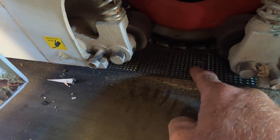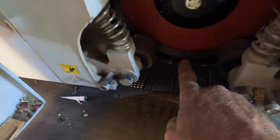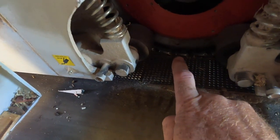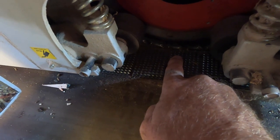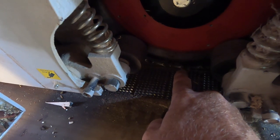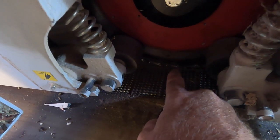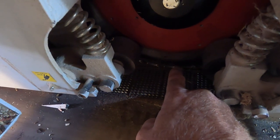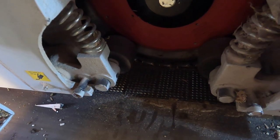Here's what it looks like inside. This is the feed chain — it's got the sharpened teeth on it. This is the bottom of the blade. Here are the pressure rollers; there are eight of them. There's a groove cut in the bottom of the feed chain, so the blade actually fits down into that groove. That keeps any chip-out or tear-out on the bottom of the blade from happening. So instead of cutting into the chain, the blade simply cuts through the board into a machined groove in the chain.